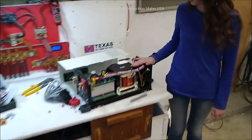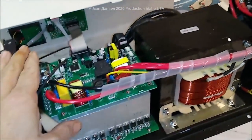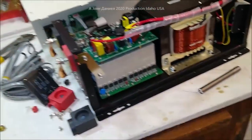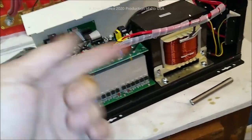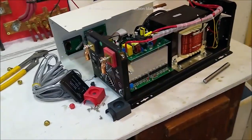Look at the size of that power inverter right there next to her. It's huge. It is heavy — this thing weighs about 65-70 pounds. We're going to be putting this one in because it has a 16 volt overvolt versus the Mean Well's 15. We're using the Mean Well now in a big RV and it's doing beautifully. The Mean Wells are impressive.